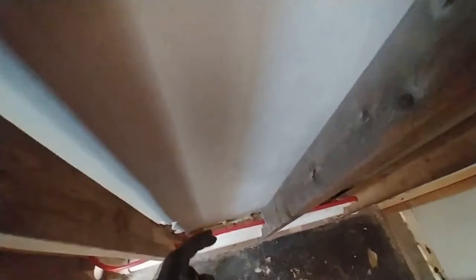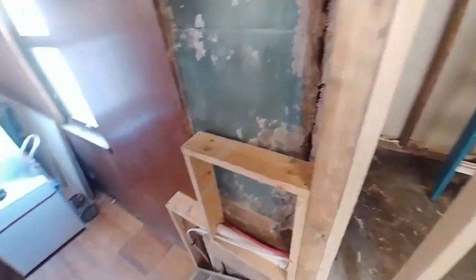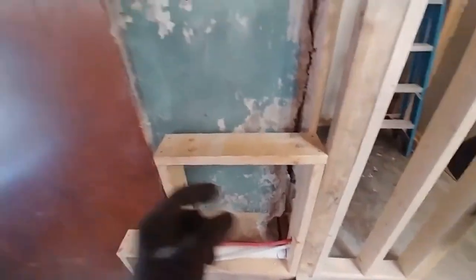And we've got a good amount of distance to this cold monolithic concrete block outer wall. We may slide polystyrene foam board behind some of these systems that are right against that concrete. It's hard to beat the R-value in polyisocyanate or expanded polystyrene foam by the thickness.